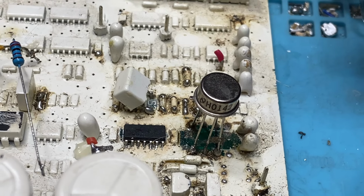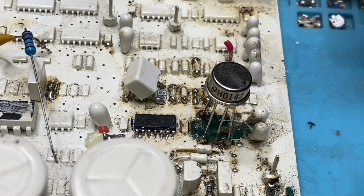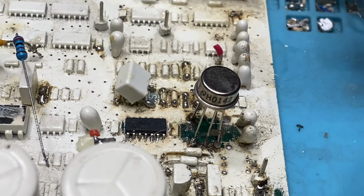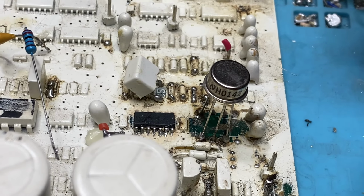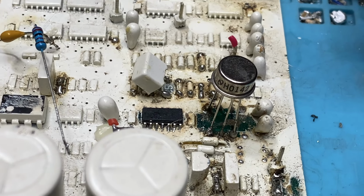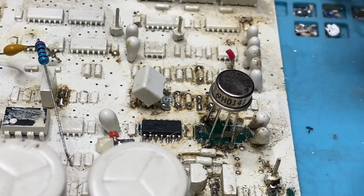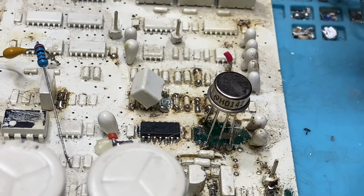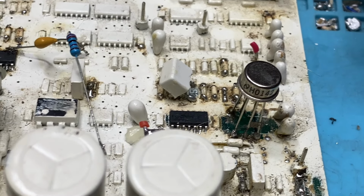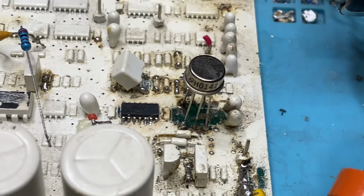And yeah, you can replace the 30 something dollar device if you tried to buy one. They could even be more now, because they're no longer made, haven't been made for about 15-20 years. You can get these out of Latvia and put them in. They work fine. Instead of being like 0.9 dB noise figure, there's something like about a 1. That doesn't make any difference on these anyway. So yeah, as you can see, it's been a bit of work done on this.